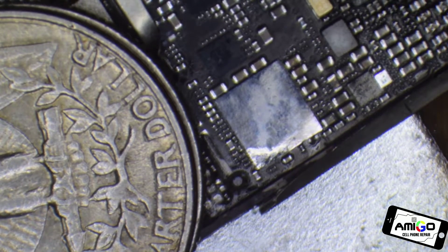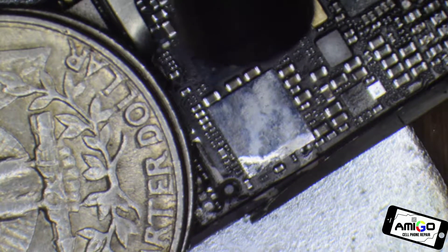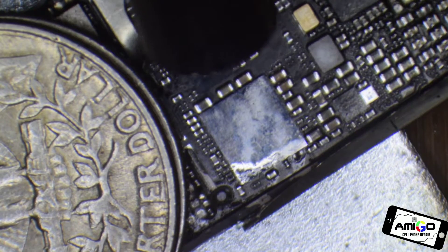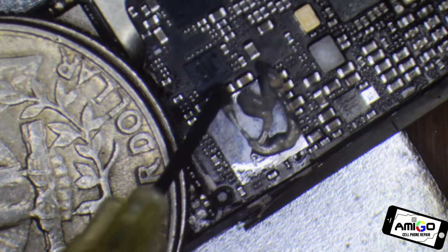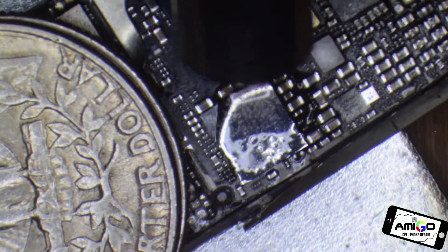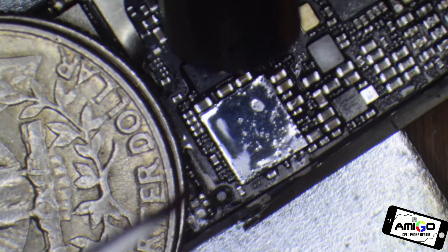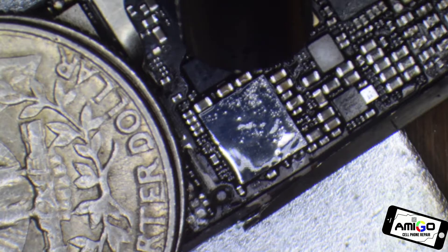I'm using an air flow of 50 because I have a bigger nozzle. I'm going to add flux once it's hot — when you add flux it's going to get very stinky. This is a very easy job if you've done it before, but if you haven't it's going to be a little bit complicated. I have a big nozzle here and I'm blowing hot air.